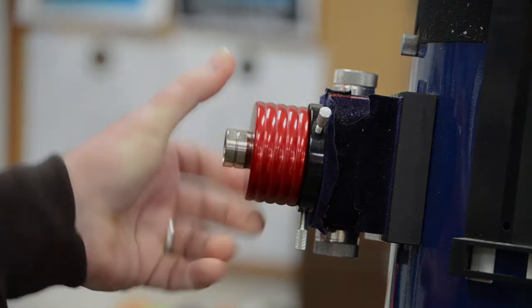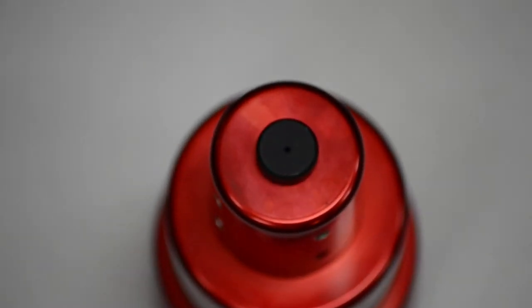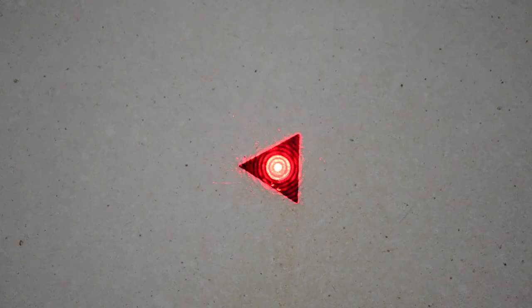Farpoint lasers have the tightest and most easily read beam on the market. Farpoint lasers have an aperture of 0.76 millimeters, or 31 thousandths of an inch. We have experimented with larger and smaller apertures, and this is the size that produces the tightest beam with the least speckling.